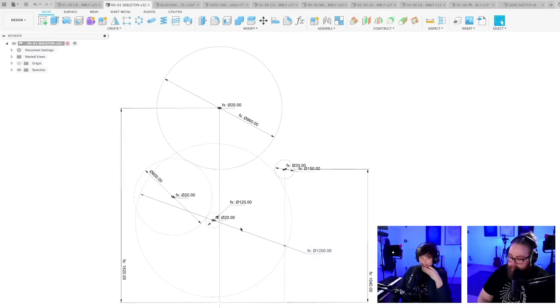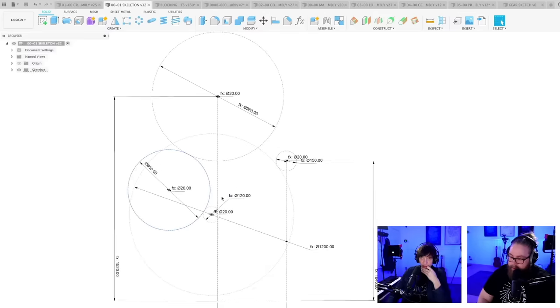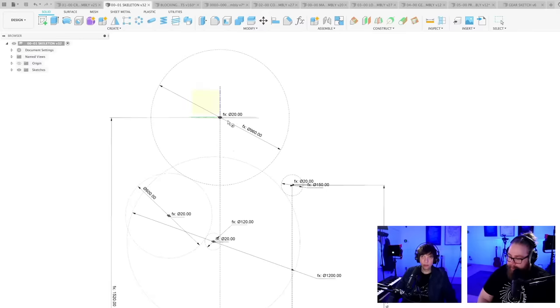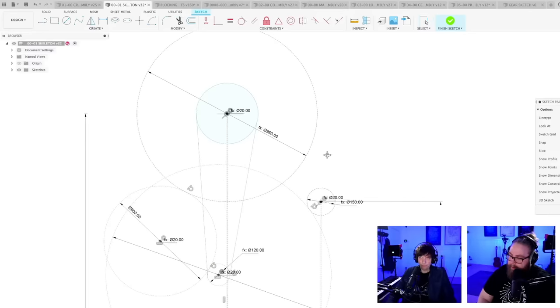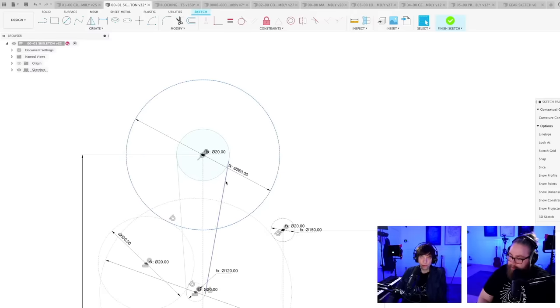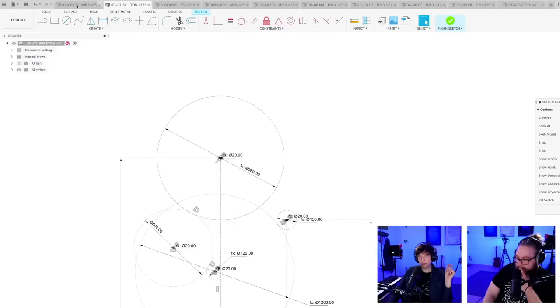So, in team belt's favor, I already feel here that we're running into placement issues fast, even with this much better solution that we have now. This is a good solution for the gears. Just to address the point that we could drive the programming wheel with a much smaller thing, but then you have a leverage issue. Let's say that we put a small gear in the middle here and we take a timing belt to this pulley here. With this timing belt, we have the force acting outside here. This is where the programming will need to act, which means the forces on this belt are going to be weaker. So that's why I'm loving the idea of whatever runs the programming wheel, I want to run it on the big edge. And that's why I like these plywood gears that we can cut with our CNC machine.